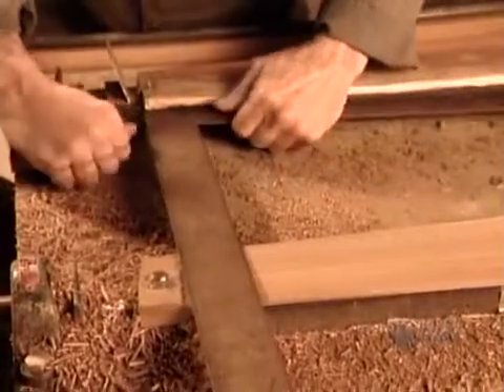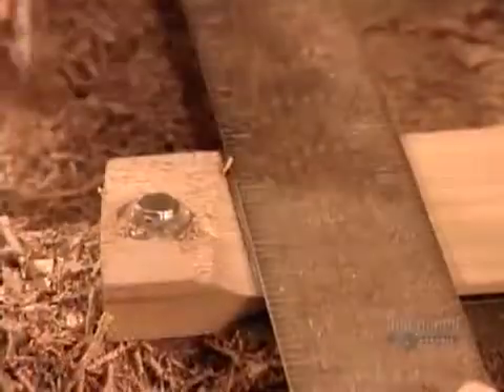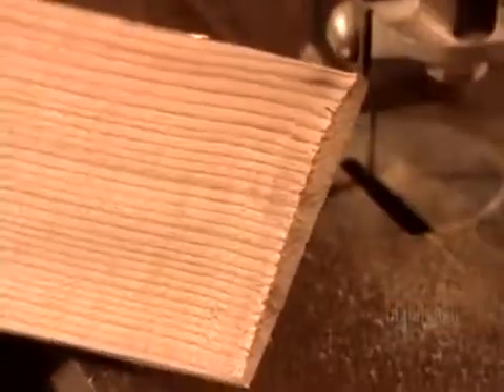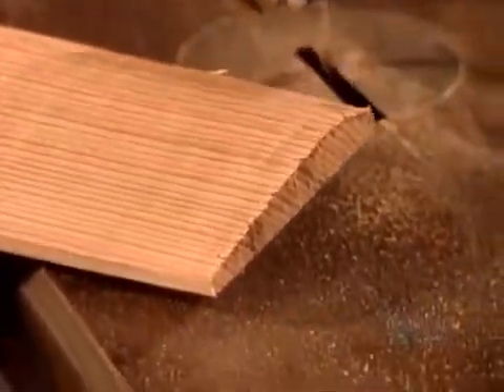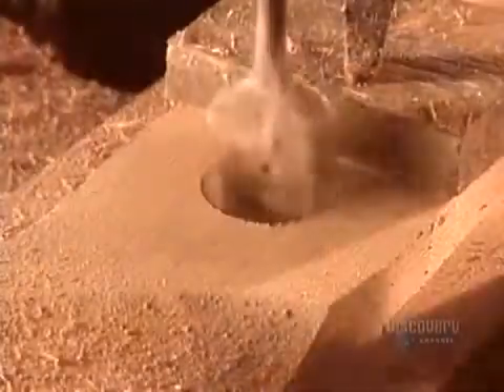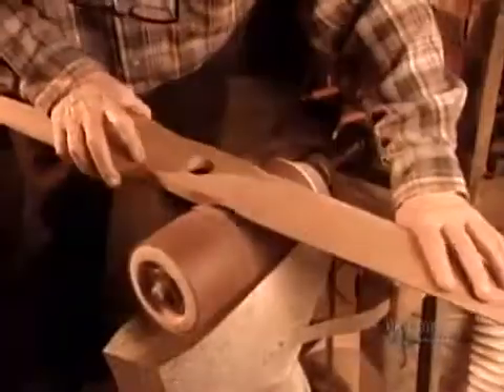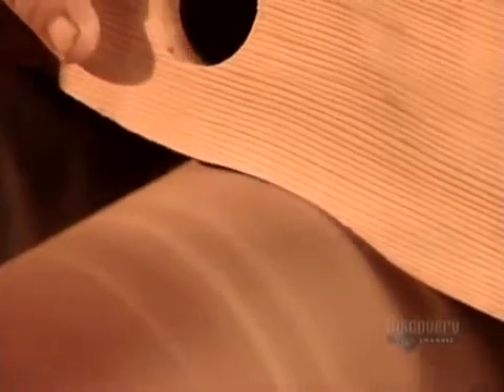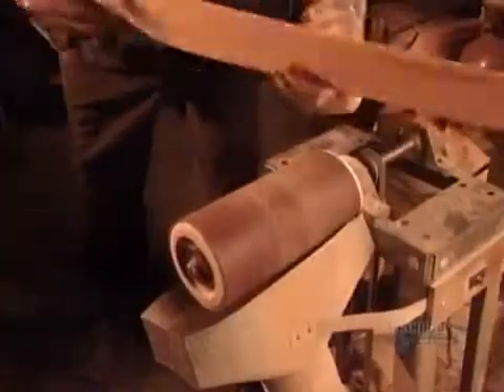You can see the profile well once they've marked and cut off the excess on the ends. One side is flat, while the other is curved like an airplane's wing. Now they widen the hole in the middle of the propeller and sand off the ridges left by the carving, using a low-pressure inflatable drum sander — the only type flexible enough to really get into the curves.